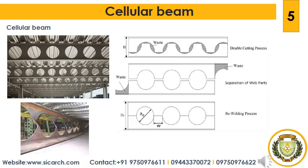Cellular beams are used to facilitate long spans resulting in flexible column-free internal spaces, reduced substructure cost and shorter steel erection times. They can be made from rolled steel sections or fabricated from steel plate. These beams are very versatile and sturdy, offering stability and support for some of the largest construction projects, while at the same time being surprisingly lightweight, making them easier to work with. Through either painting or galvanizing the beams, it is possible to drastically alter their appearance without sacrificing stability, allowing us to perfectly recreate our desired designs.